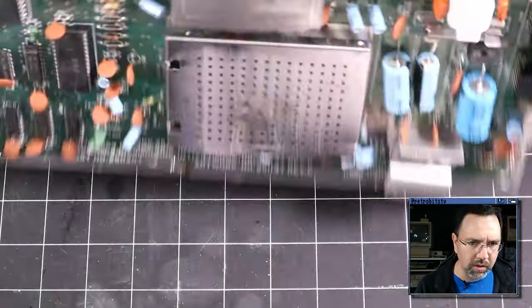All right, so we're looking at the CPU again, since we're not sure if that's what's bad. And I'm probing the data lines. They start at 7 and they go all the way to 23, skipping 21. But if we look at pin 7, that data line's looking pretty good. Looks like normal traffic, looks like the normal levels. 19. What's going on with 19? Those look like triangles, not squares. Yeah, that doesn't look right at all to me. 20? Nothing going on pin 20. And we skip 21, pin 22, nothing going on 22, and nothing going on 23.